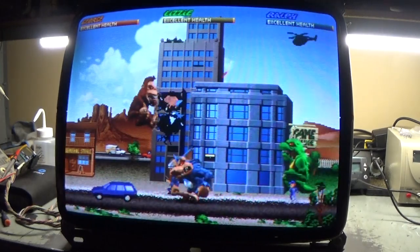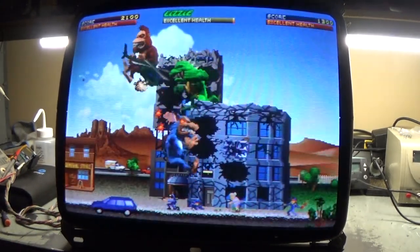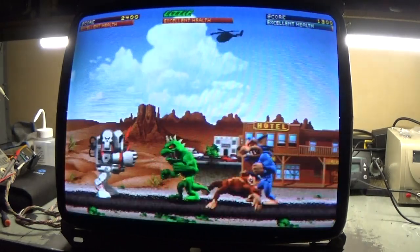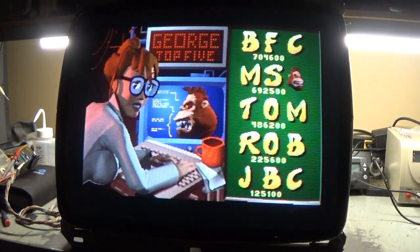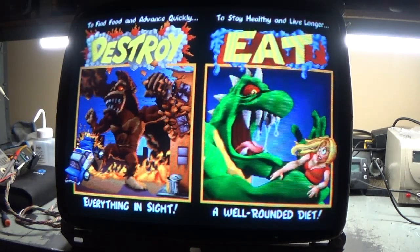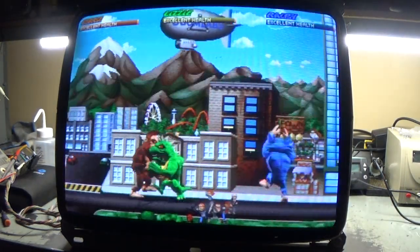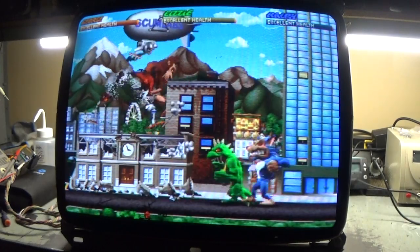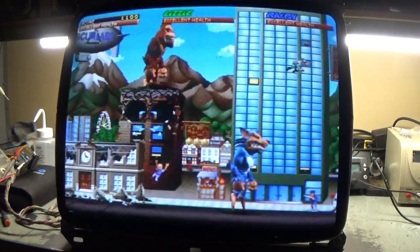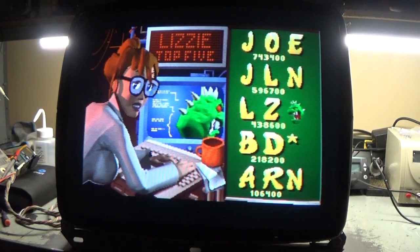So, okay, I think that about wraps it up. Not sure what else to go over. I mean, there wasn't really anything wrong with this, so to speak. It's kind of unfortunate because we didn't get to talk about troubleshooting collapses or troubleshooting blowing HOTs and things like that, because I guess we got lucky with this one. We didn't need to worry about any of that, but I'm sure sometime down the road we'll have one come across the bench that we will have to do all that with. So if that's what you've been waiting for, we'll have to wait a little bit longer, and I apologize. But at least we got some good information across this time, and we'll let this run, do a burn-in, make sure it doesn't blow up again. But yeah, all that was wrong with this was bad caps caused by bad flyback, and just needed some reflow.